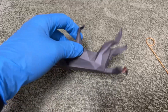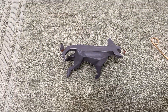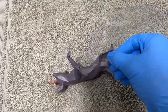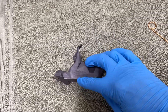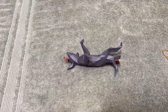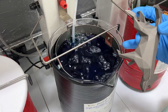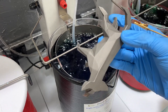It's been over 24 hours since we sprayed it, and now the next step is plating this in our bright acid copper solution. Something a little different will happen here — where it's more conductive it's going to plate heavier than the further ends, because it's not a solid piece of metal and it's not super conductive. It'll spread from probably the bottom where it's touching and spread up to the ends of the legs. We're going to plate it for about five minutes, take it out, and look at it. Our tank is at 1.5 volts at room temperature.